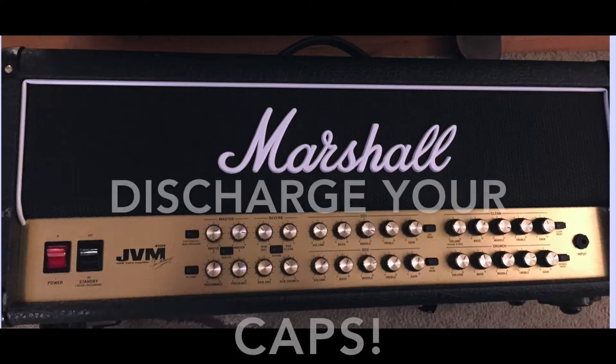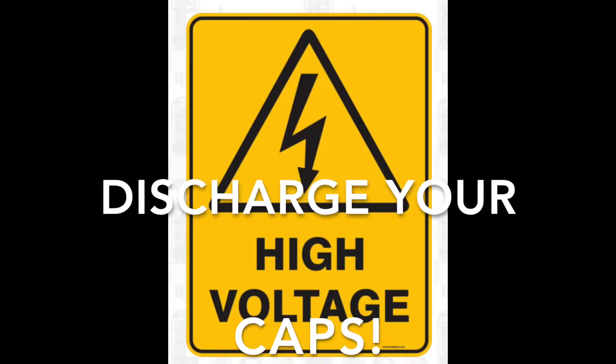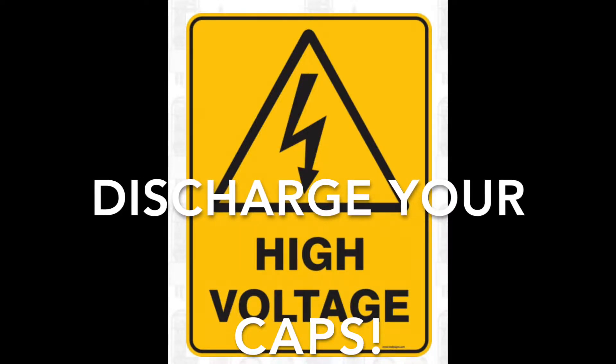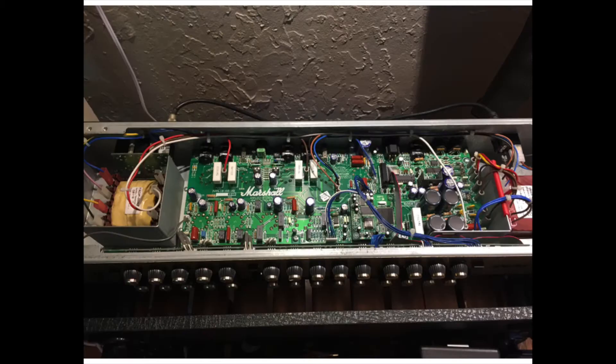There is a safety note: if you haven't worked on tube amps before or you're new to electronics, I suggest you do a lot of reading and understand how to dissipate any charge left in the capacitors. I'll put a link in the description — please do your homework. I don't want to hear of anyone shocking themselves; 400 volts can be pretty tough. Now let's get started.